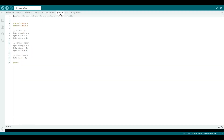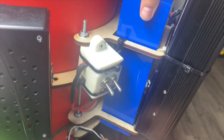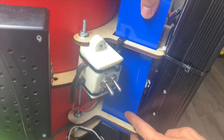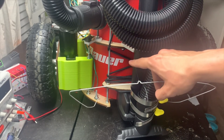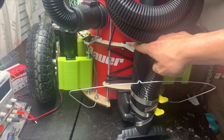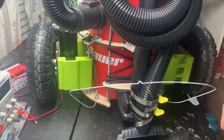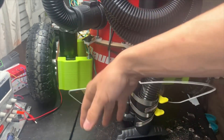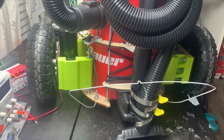For the robot logic, he's using a standard Arduino Uno with a brushed motor control breakout board. What's maybe my favorite part of this design is the coat hanger limit switch bumper he's put on the front. A length of fishing line runs from the coat hanger wire to a standard limit switch off to the side. When it bumps into something, the tension is released on the fishing line and the limit switch opens, signaling to the Arduino that it needs to change direction.